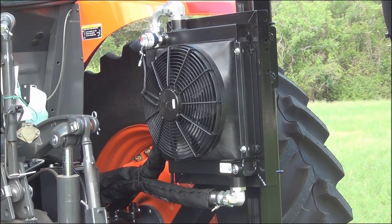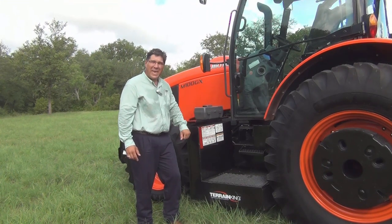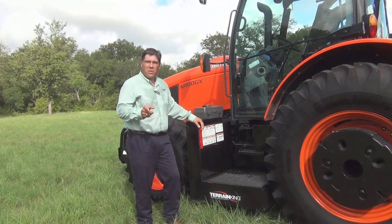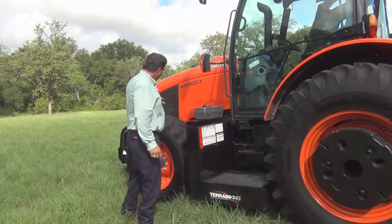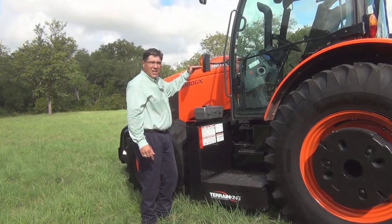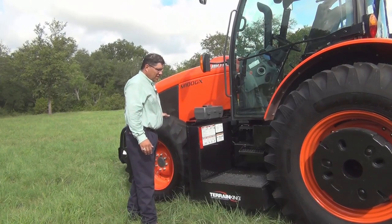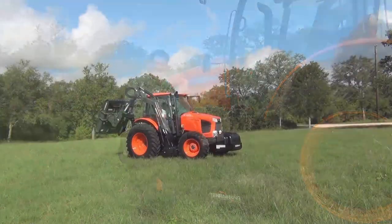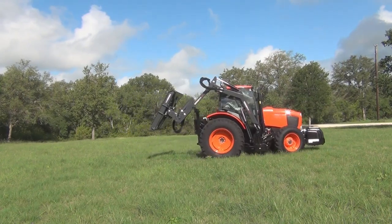Let's take a look at the other side of the tractor. The Terrain King KB Series Boom features an L-shaped counterweight made of solid steel billet — there's no oil reservoir in this location, and that's very important to you as an owner-operator. When you're sitting in the seat, you need adequate visibility of the front tire. When you put a reservoir here with 50 gallons of oil, it totally blocks your vision. That low counterweight is really key to the success of this boom mower system — it provides a low center of gravity.